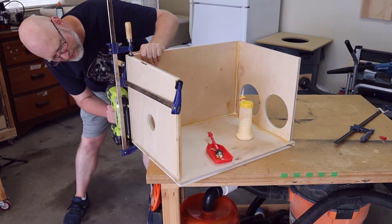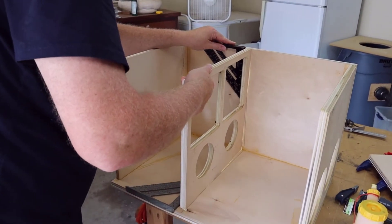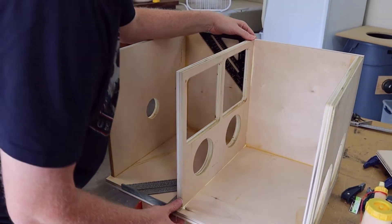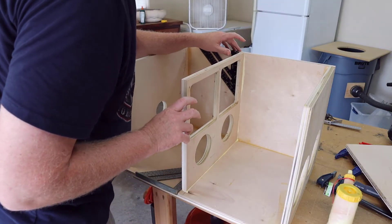I typically start with a bottom or a back to form a base and then get a side up. After you get a couple of sides up, you don't really need as many clamps. Now here I'm installing the brace — the exact position of the brace isn't really that important, you just have to make sure it doesn't interfere with the speaker cutout in the baffle and doesn't interfere with the internal flares on the ports. But it is important that you get the brace square. I've got more than one speed square, so I'm using a couple of them at the same time. That's going to be real handy later when I go to drive in the brad nails from the outside of the box — without marking it and making sure it's square, you're just going to miss the brace when you start driving your brad nails.